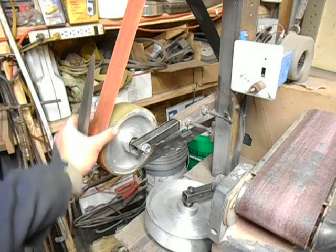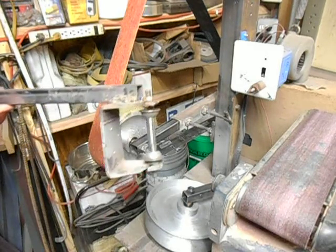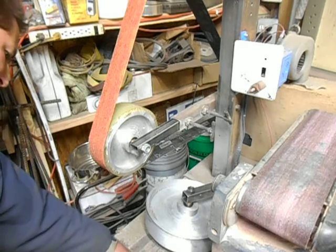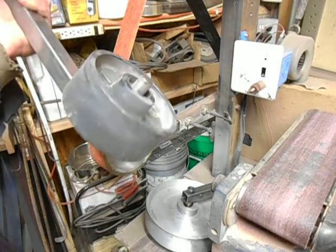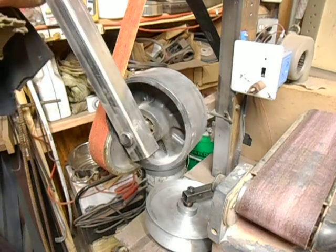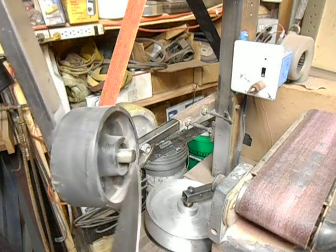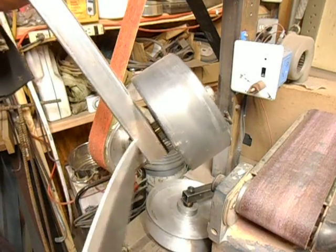But this new castable rubber, I'm really excited about it. I'll have to run it for six months to a year and then come back and give you fellas an update. There's also a small wheel attachment — that's one of my next projects, to make a real nice one of those. I think I've got a five inch wheel also, which is just a caster wheel off of some sort of industrial cart. I just drilled out the center, pressed an automotive water pump bearing in there, and drilled a hole for the bearing shaft to go in.